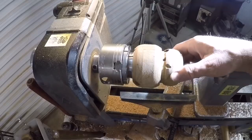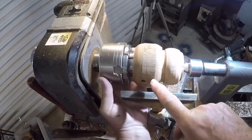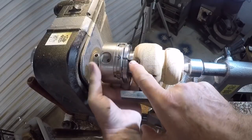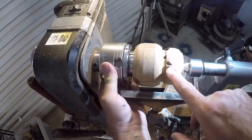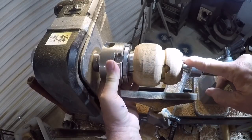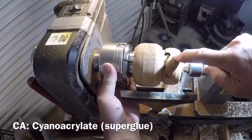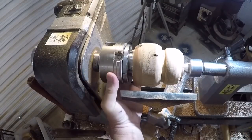Just a stop here to examine the work — this is the kind of stuff I've been running into. There's a nice wormhole feature going through and some cracks that I think are actually going to be okay, but I will have to stabilize those. There's a little branch coming off. On the lid part I've got a couple of pretty good wormholes that I did not see in the blank, so I'm going to have to address those. There's one at the top that kind of runs through, so I'm going to flood this with some CA and see if I can stabilize it. When I get this piece done I'll sand that out and it should still look like it matches.